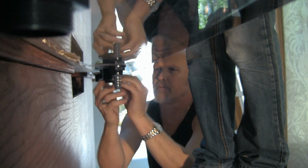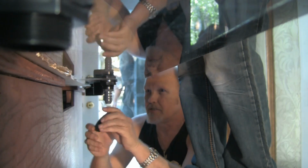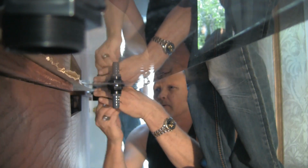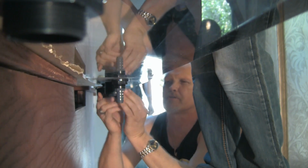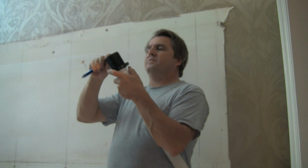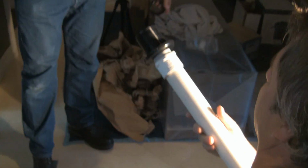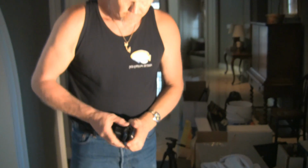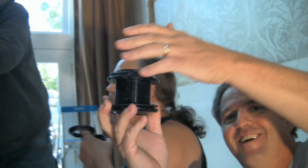And why am I having such a hard time getting this nut started? Just turn it. Something just doesn't seem right about that one. There's just something not right here. Pull that whole Durso out. Something's wrong with that. Somehow, the threads on this bulkhead got damaged. I always buy an extra one or two of many of the fittings, and in this case, I have an extra 1.5 inch bulkhead to use. But something quickly makes me aware that there's an issue with this bulkhead as well.